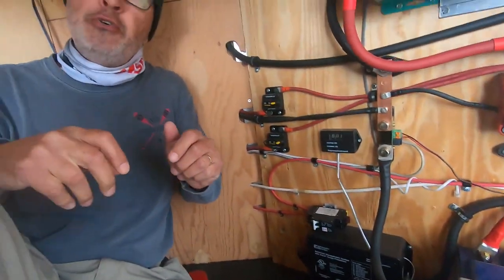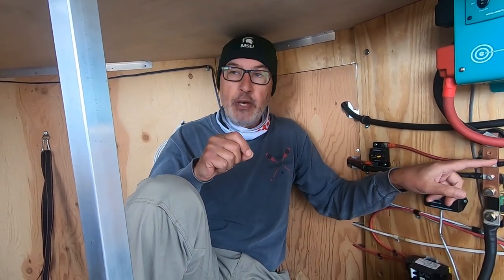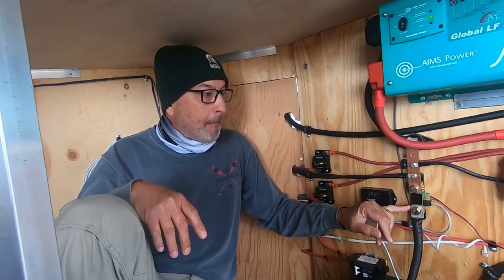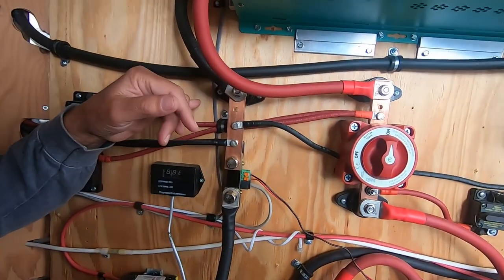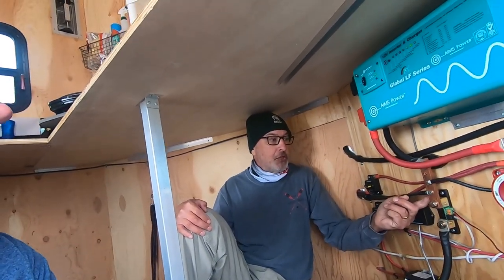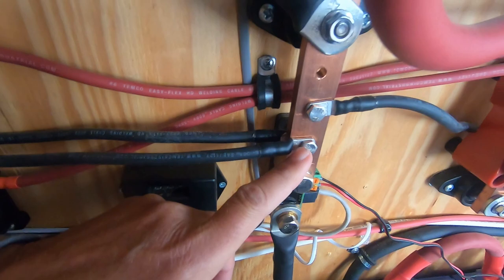Yeah. The basic idea of using bus bars is so that you can eliminate the terminations. Right. The terminations meaning all the ends that you have to put on cables. As opposed to this, I can have a bus where, basically everybody's seen them out there. They're kind of like this. It's kind of like my shunt, but it's a bus bar. You just bolt it directly to it, and it has a bunch of bolts already on it. It comes with the hardware. You just screw them down. The other thing too, this is a good example with a bus bar. I can have two negatives coming into my bus bar, and it's captured by the same fastener here.